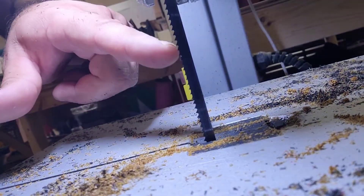Now, that particular blade I just installed — I went from a 14 TPI to a 10 TPI. If you don't know what TPI means, it's teeth per inch — that's how many cutting edges are on the blade per inch. So this one is 10, the one I took off was 14. The 10 is way more aggressive, but I feel like the 14 melts it a little bit more. Are they both good? Yes, absolutely. Will one work better than the other? Potentially.